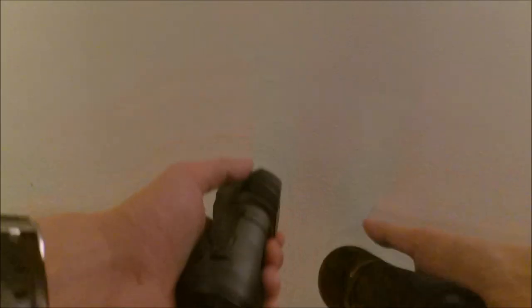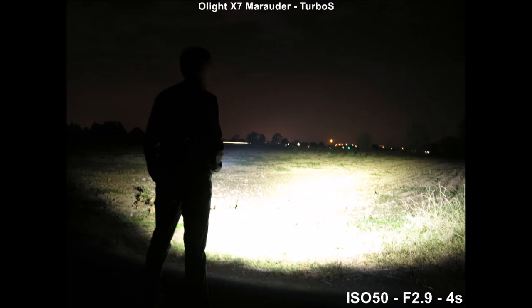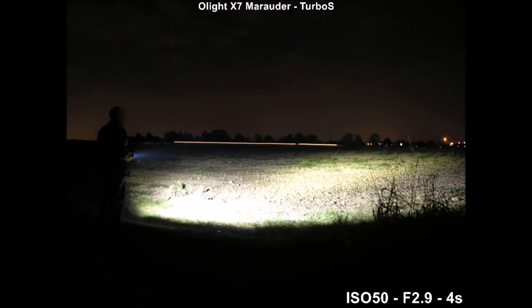Now here I'll roll a couple of beam shots. As you can see, despite having more than 9,000 lumens, this light doesn't have a lot of throw. These are very big-die LEDs — large surface area — with a very small reflector, so the beam is very wide and very homogeneous. There's still some resemblance of a hotspot and some petals at the outside of the spill, but for close distances there's no problem. This light is made for close-distance illumination.